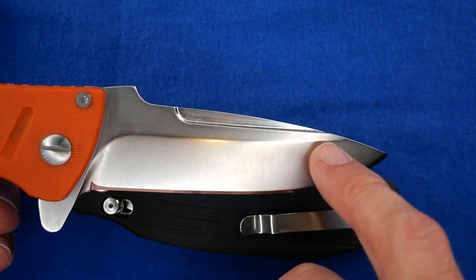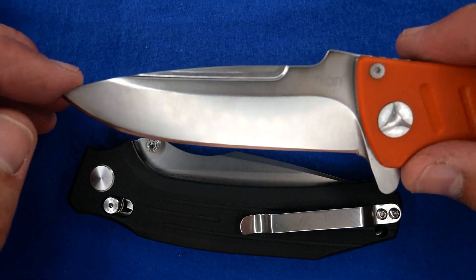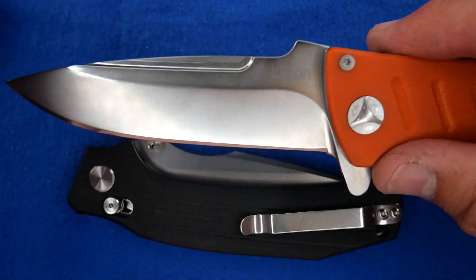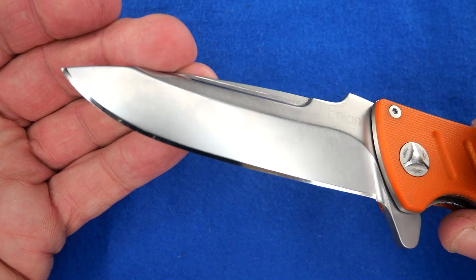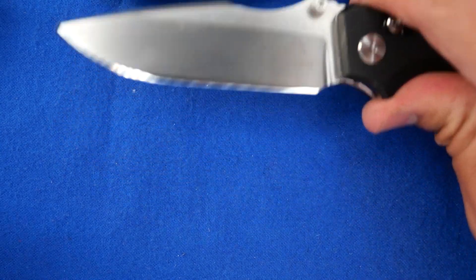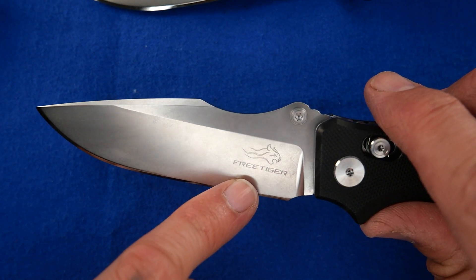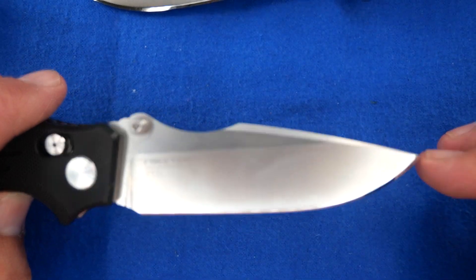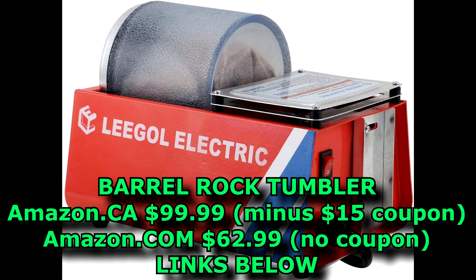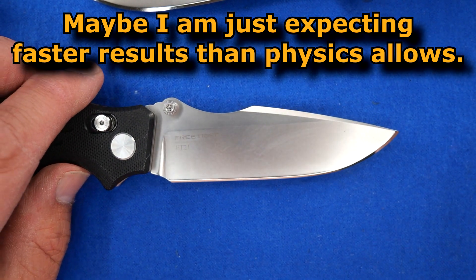On this side it did an awful lot more than even the rest, so it's kind of spotty. This is the 8Cr13 knife, and yeah, I did sharpen it quite well — it's got a nice mirror edge now. This knife is the one where I reground the belly because I had broken the tip off. And look at that — it's just beautiful. The stonewash has taken off most of the logo; you can just see it faintly there now. It's a very light stonewash. I think a barrel that rotates with ceramic and ball bearings inside it would be much better and much faster. This thing worked, but it took an awful long time.